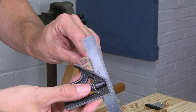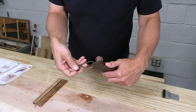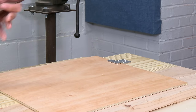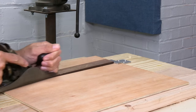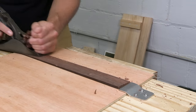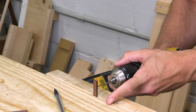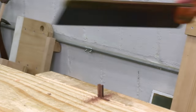Don't forget to double-check when you're done — those angles need to be correct. The front of the sled needs to slip over the front of your plane. Every plane is different, so you need a spacer that's as thick as your plane's toe. I've got some thin walnut, but it's too thin for my planing stop. A scrap of plywood fixes that problem, and I can plane that walnut no problem. If you don't have a planing stop yet, try the Compass Rose Ready Set Planing Stop. It's the most affordable steel planing stop on the market, and it works great. Making the spacer is delicate work, so I'm using my smallest tools, holding the work gently and going slowly.